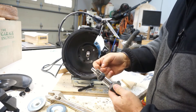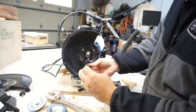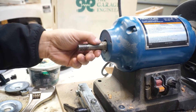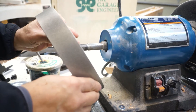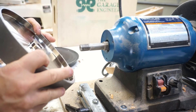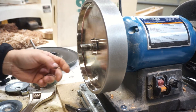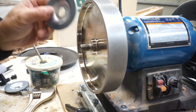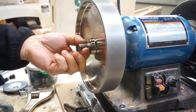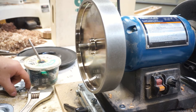Now we just need to get the wheel and protective guard off — I probably need to change the bit to a number two. Now we've got the grinder down to the arbor. Let's test it to make sure it fits smoothly — and that's good. Instead of reapplying the offset that came with it, I think we're alright because we're right at the bottom of the thread with plenty of meat on there. So what we need to do now is go ahead and put a washer on it and reinstall the nut.